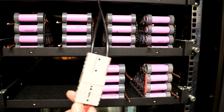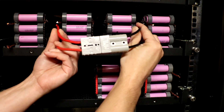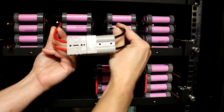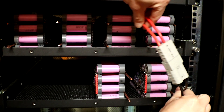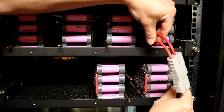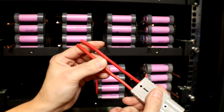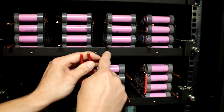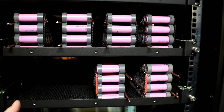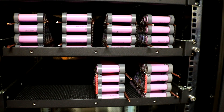Sorry if the lighting isn't too bright, but with these Anderson plugs each pack will go to wherever the negative side ends up, so I can have an easy disconnect. If I'm going from shelf to shelf it'll easily reach. I was tempted to use the 10 gauge wire because it's already connected — it's just a little smaller in diameter. Anyway, I've got six packs all soldered up and I'm still working on the seventh — all the fuses are on, I just need to do the negative side, then I'll have seven more packs to do.